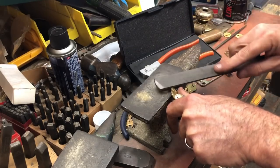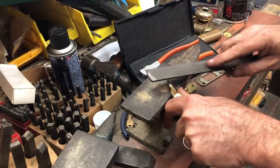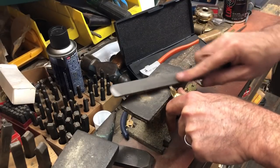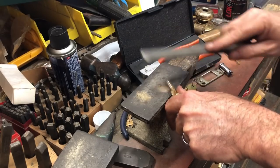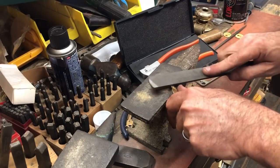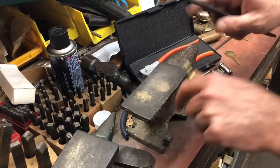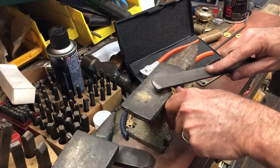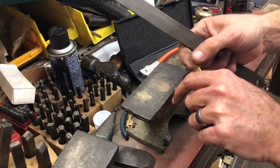Now the finished key, once you get the cuts and get it turning, you do not want to give the customer the key with this angled edge, so you are going to have to duplicate your impressioned key or code cut it once you discover what the cuts are. This is one way to do it, just with a hand file. Typically, if you're in the field, this would probably be the easiest way to do it.